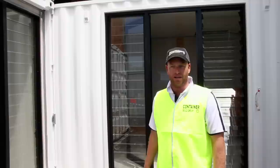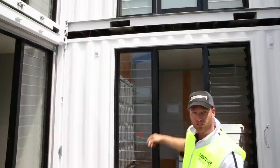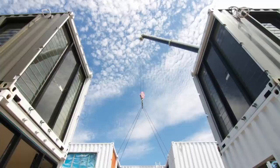This is the last one getting delivered now. What's happening here is we're holding this container off the top by 100mm. That allows our plumber to get in here and pull all the plumbing pipes through to the next one. What we do is we have our pipes from the upstairs bathroom — they'll connect through this access hole, we'll join them, hide it in the access, and then we'll sheet these ceilings on site after install to get a nice streamlined finish.